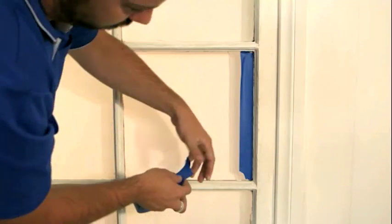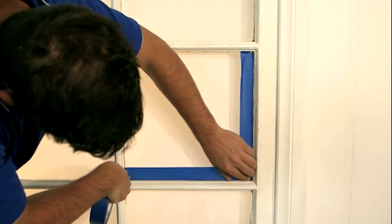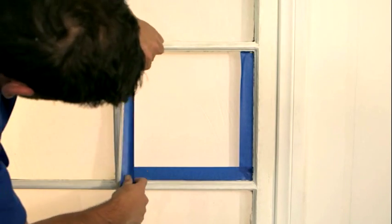For windows, simply place strips of masking tape along the edges of the window. This lets you paint smoother strokes without the worry of having to scrape the glass clean afterwards. Use masking tape to protect any surfaces next to the trim you're painting, but make sure you choose a quality masking tape so it doesn't bleed or peel once the paint is dry.